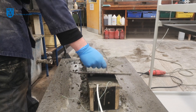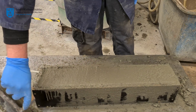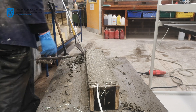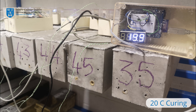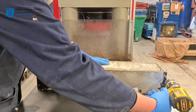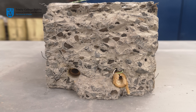You may then run the float across the top of the surface to improve the smoothness. Please clean the excess concrete from the side of the mould, and the waste concrete should be returned to your bucket. Your beams will now be moved to their storage locations by the technical team. Half of the beams will be stored at 20 degrees Celsius and the other half at 30 degrees Celsius. The concrete will be removed from the mould in 24 hours, and the beams left to cure in their respective environments for a further 6 days. The curing process, as well as the testing of the beam, will be covered more thoroughly at station 8.